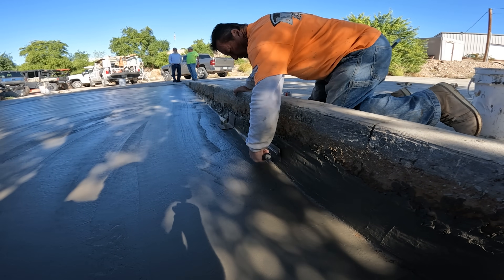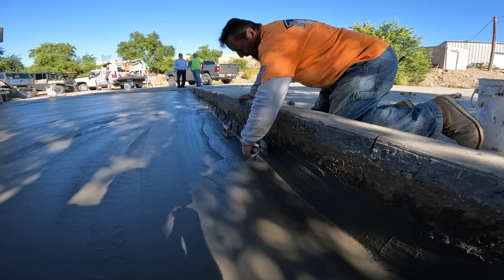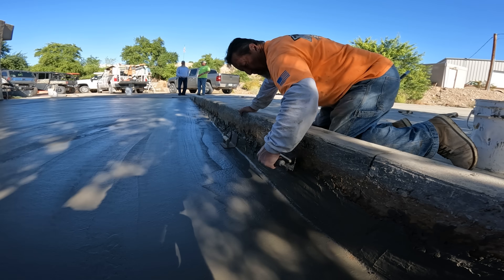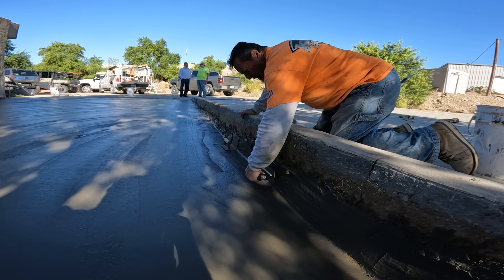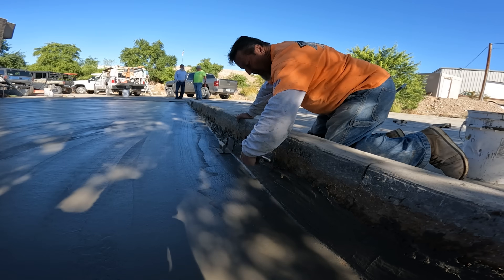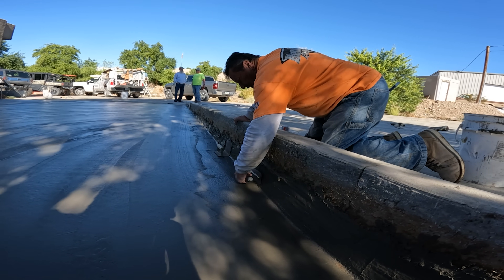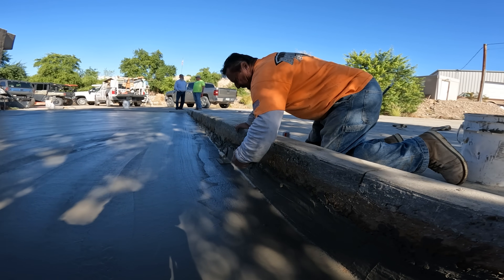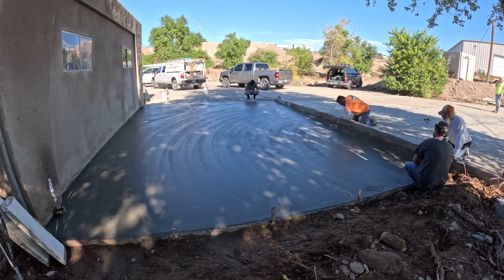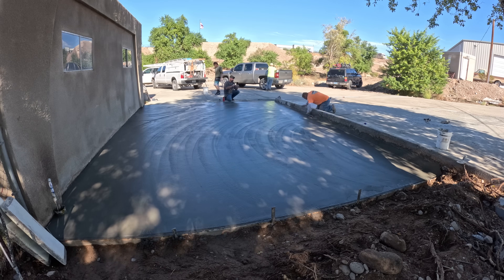Here are the tricks Kenny's showing — just doing a little by little. There's no hurry, he's got plenty of time, so he's just kind of working it. He's got the big rock packed in there tight. We had about a two to three inch recess. He packed that in, and as the slab got harder, the concrete in the bucket didn't dry as quickly because it was encased in a bucket — the water couldn't evaporate out as quickly. So he's waiting for that slab to harden so he could pack that curb.